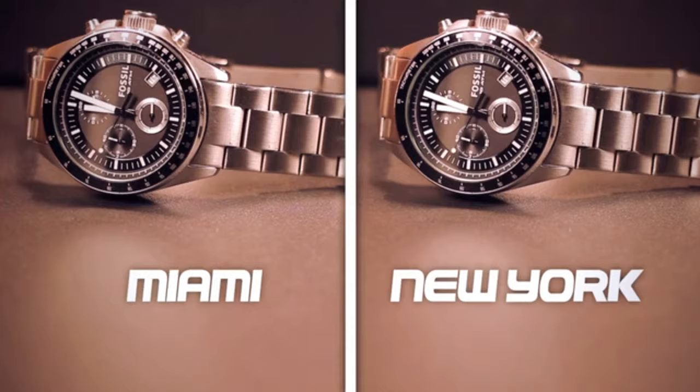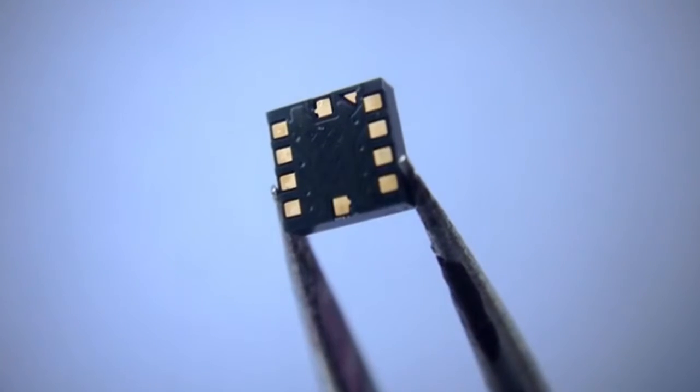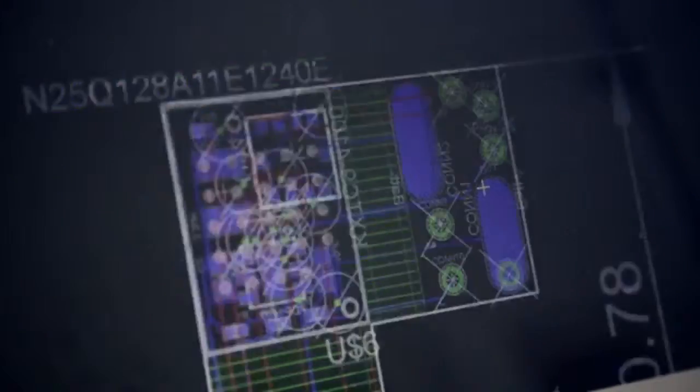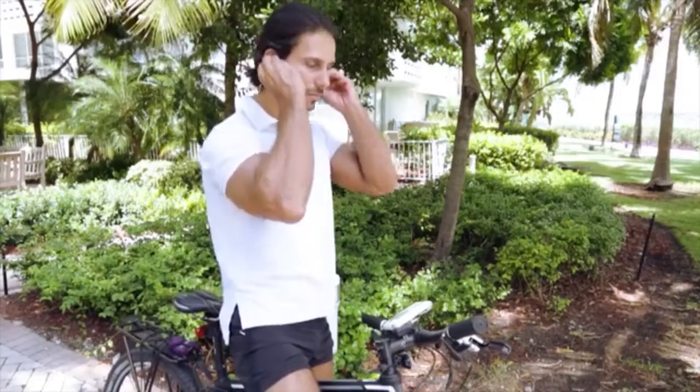Just as two perfectly synchronized watches keep the same time without being physically connected. The teeth bite creates a vibration pulse that travels along the jaw bone. The vibration has a distinctive signature, which is detected by a custom-made 3-axis accelerometer. We have built a redundant near-field radio link to ensure that the earphones do not get decoupled when tracks are changed with a simple bite.